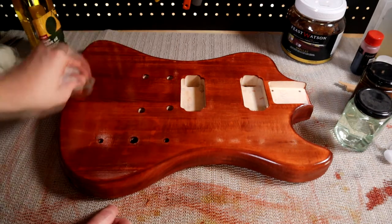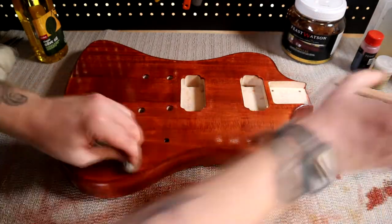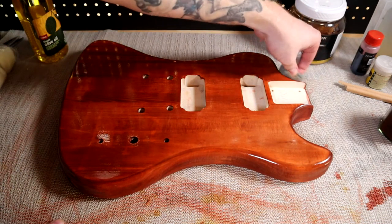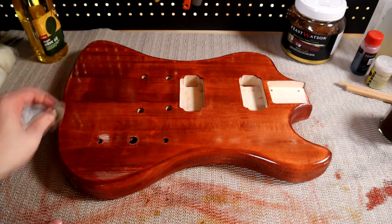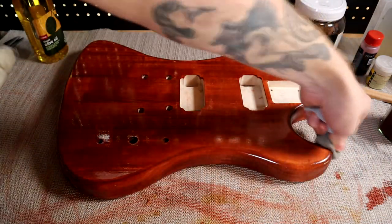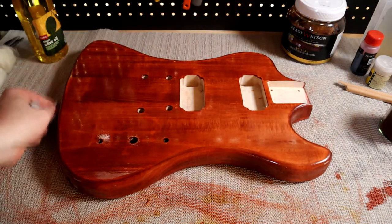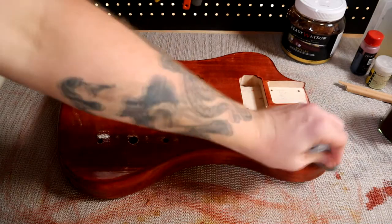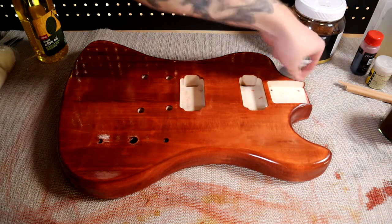One thing that isn't talked about though is it's repairable. So if you do damage the finish, you can just break out another cloth with pre-mixed shellac on it and work in a fix. So it's not as scary as you would think. The art of it is patience and getting a feel for how much you apply to the cloth. As I said earlier I already put too much on, so I'm going to have to work this in for longer. But the oil was a great trick that I've now learnt and am sharing with you.